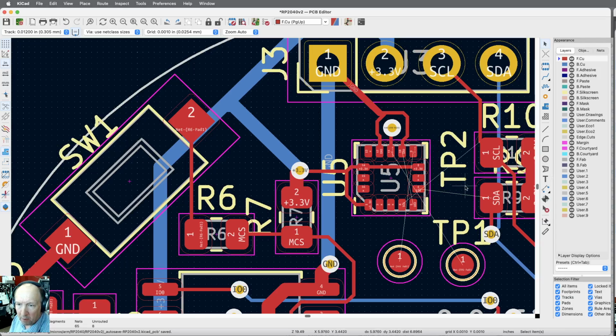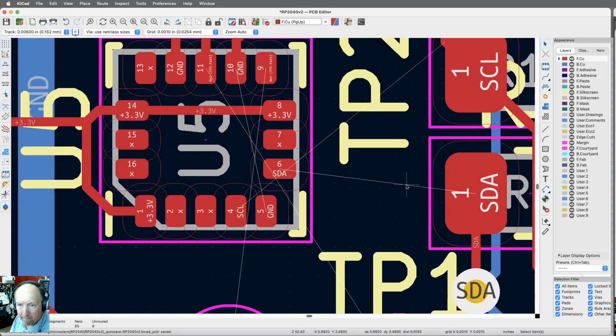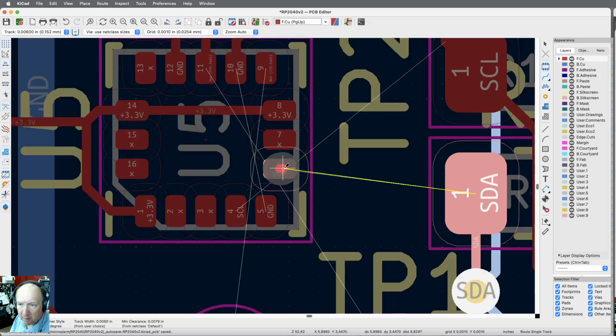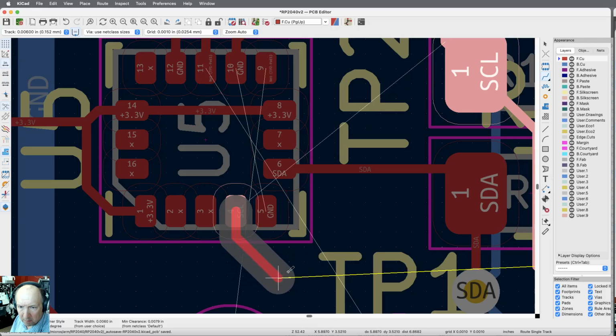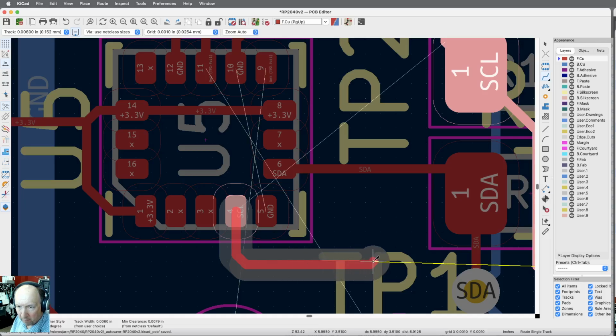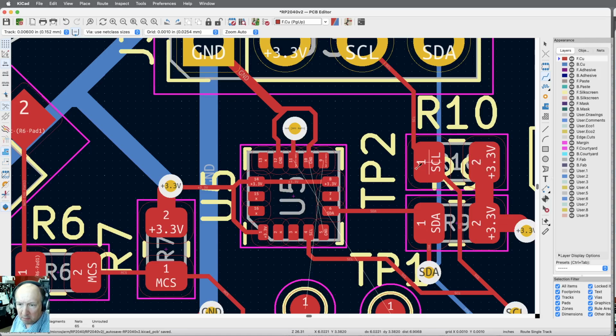Okay. So what are we down to? We're down to 8. Now the SDA line and SCL lines are not too shabby. Let me get SDA connected. So that's a short, straight one. Oops. We're too big. I need to be 6. Trace that to there. And this one. You know, if I go through below that via, that'll get me there. When I don't have to add another via.